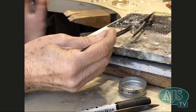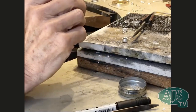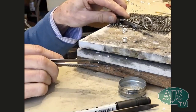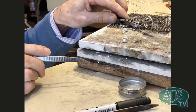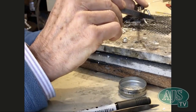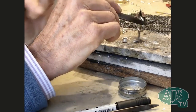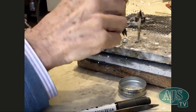You will have 10 times more control. And I always say this to people: the minute you pick up a ring and you think, oh yeah, I'm going to solder the ring, and I'll pop it in my cross locks and do the solder join, it's probably the worst thing you can actually do. The tweezers are great, and they are good for holding some objects, but if you can put a binding wire between you and that object, you'll suddenly be a different goldsmith. I promise you.